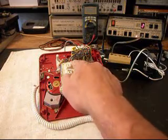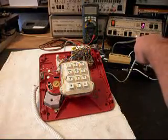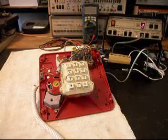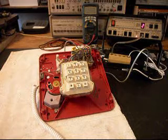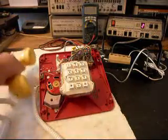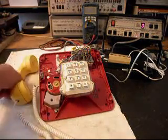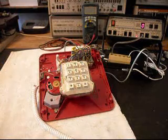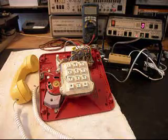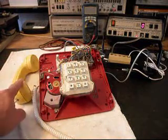And I want to end in a 2. Now I want to transmit into the handset. If you watch that red light on the analyzer, that's an indication of 100% modulation on transmit every time you see that red light light up. So we know that this telephone, we'll check it one more time, is dialing out, it's receiving properly now, and it's transmitting.